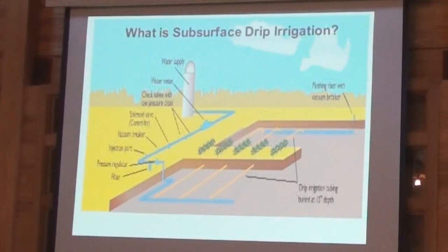Here I've got this diagram of just a water source — whether it be coming from a well, pumping into a storage tank, or maybe even using surface water. We've been able to do that here recently and we've been very successful as long as you have a good filter system. But whatever you come with from a water source, I'm thinking flow meters. We've got to be able to monitor that flow and keep up with what's going on, because having the drip tape buried in the ground you can't see it. You don't know how it's performing — it's not like having a center pivot irrigation out there running. We can clearly see those sprinklers when they're stopped up or have problems. So one of the things we have to go by is those flow rates.